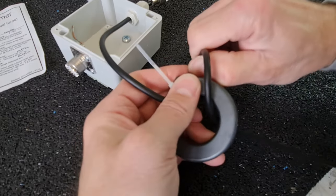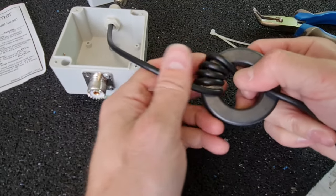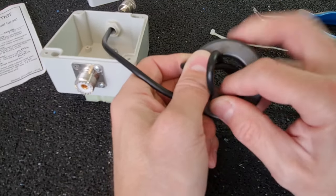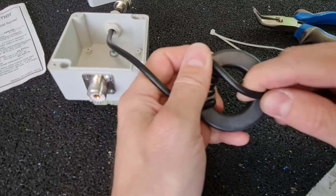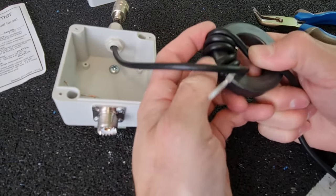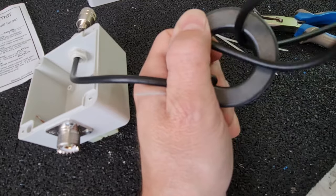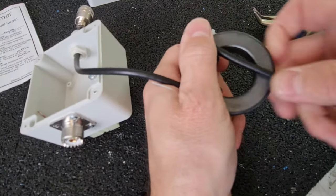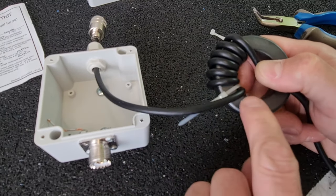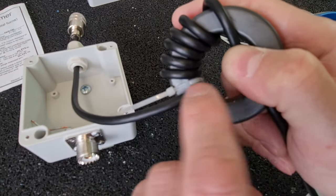All right, so be sure that each turn of the coaxial cable is tightly wound to the toroid surface, to have a good RF connection with this toroid. Yeah, you have to be prepared that it is hard work for my fingers, because of the thickness of this coaxial cable. Therefore I recommend to use a softer version of this coaxial cable. All right, so the coaxial is going through the hole, which means that is a first turn.